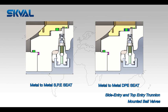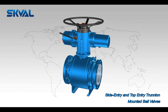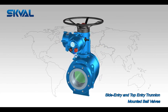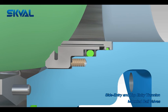Also available are metal-to-metal SPE and DPE seat configurations. Metal seat valves achieve a metal-to-metal seal by means of a flexible seat with ball and seat sealing surfaces coated with tungsten carbide. Metal seats are typically used in potentially erosive or abrasive applications caused by the presence of solids.